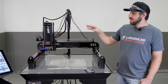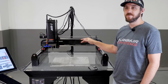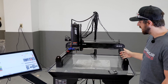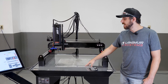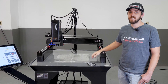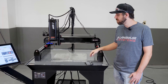To find Z zero, the first step is to turn on the spindle at 1000 RPM and go touch off the corners. Before I do that, it's a good time to talk about basic safety. Number one: safety glasses — super important, 100% mandatory whether you have an enclosure on your machine or not.